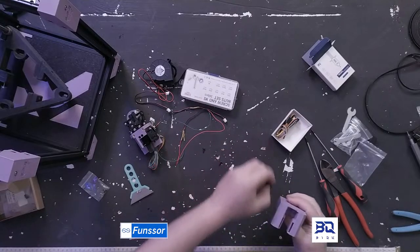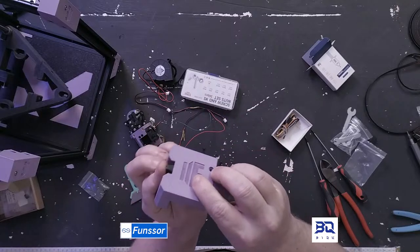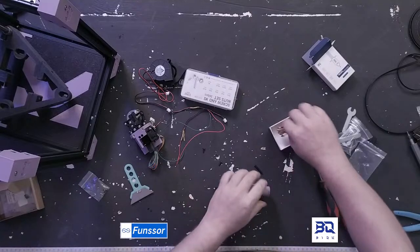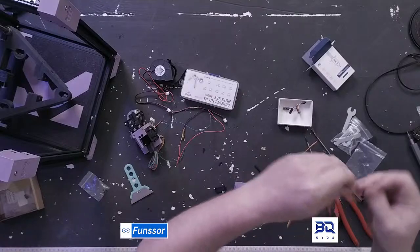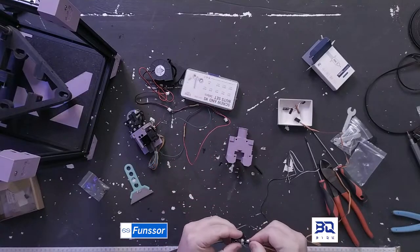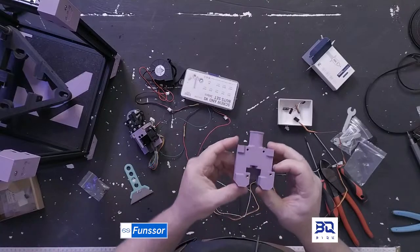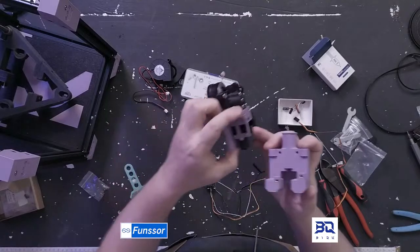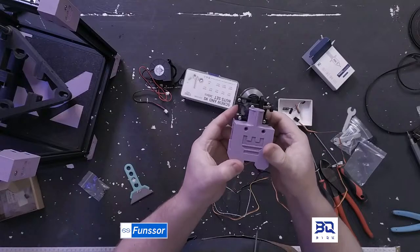Okay, so I'll put the microprobe in here. I specifically made a hole for it on this part, and it'll just show slightly. The way I did this, it's not the most compact, but it's pretty compact considering this is a complete tool head with auto bed leveling and CPAP. And I'm actually really happy with how this all came together, because fitting the microprobe in here with a stock setup with a 50-15 just isn't possible. I would have had to use this space for cooling, and then remove one of the ducts. That was my option to get a microprobe on here.